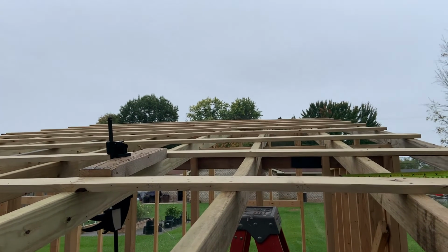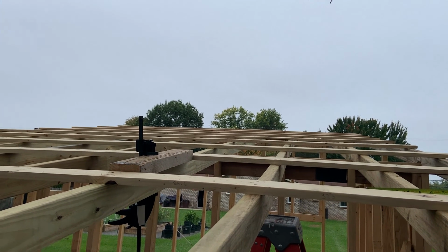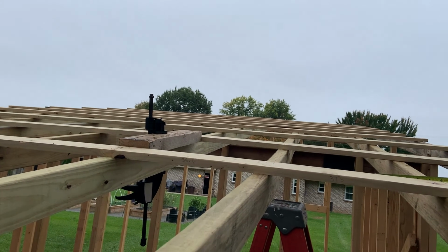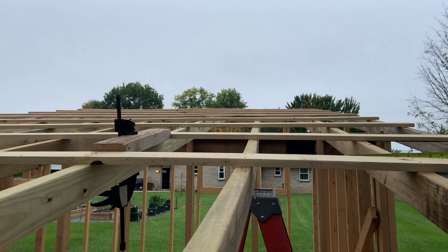Welcome back. It's only been a couple of seconds for you, but it's been several days for me. I've been working at getting the purlins up on the trusses up on top. Let me show you how far we've gotten and why we have to stop and move to the next stage to make all of this work. As you can see, we've gotten all of this done to about 4 feet past the back plate of the shed. But now we're going to have to take the time to put my 4x4 posts into the ground and get my back header up. Here's why.